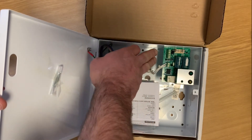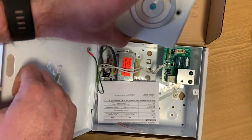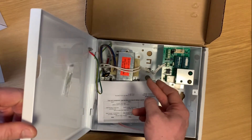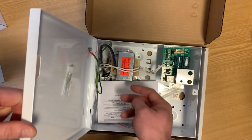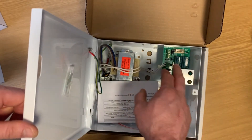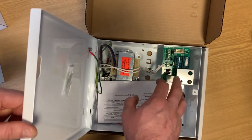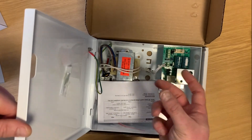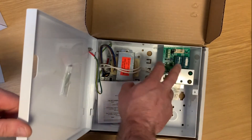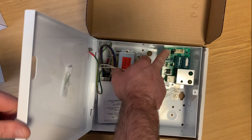You have an output here which is your 24 volt output to your door holder unit, and then you have a control input here. This is looking for just an open or closed contact, and you can set the dip switch to say whether it's open or closed. You take an IO on an addressable fire alarm system, or connect it to the relay on the fire alarm panel. Alternatively, you could use a relay on a plate — an RPL24 — as opposed to randomly attaching a relay to a plate, and that will take a 24 volt trigger and give you a dry contact that you can then use to trigger this.